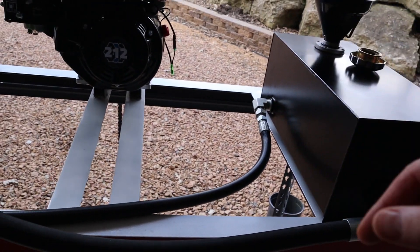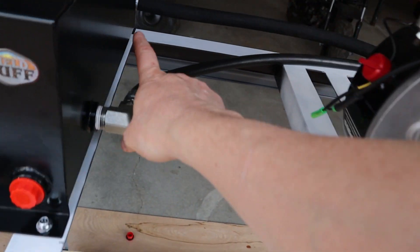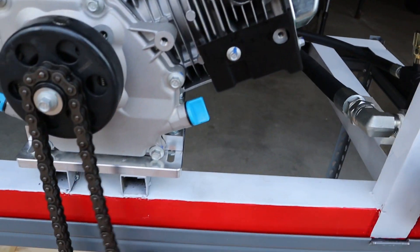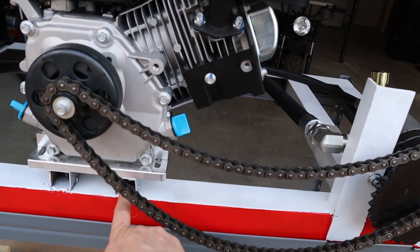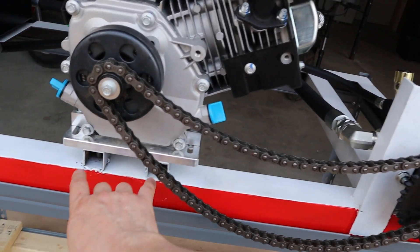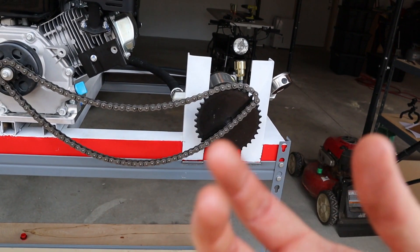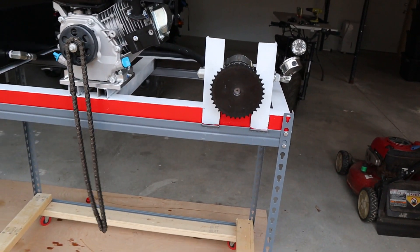In this design I do not have a hydraulic filter, but adding one would be easy — you just take the 1/2-inch line, run it into the filter, and add another hydraulic line and a couple of adapters. The chain is a bit longer on this model since I'm going to be putting in an additional mount — smaller engines will be mounted closer with a shorter chain, larger engines will use this mount. I want to do some 420 engines on here but don't really want to go over 20 horsepower. This is a homemade dyno and there are a lot of dangers in running one, so I'm going to keep it light for now.